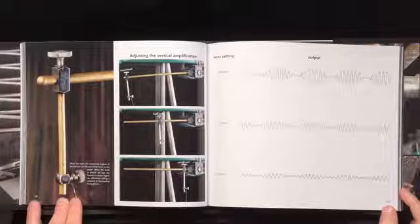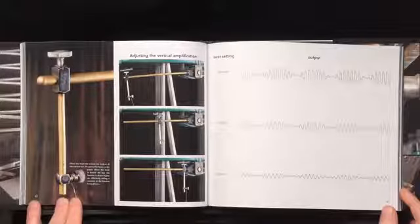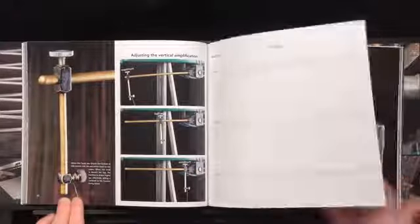This vertical rod allows the operator to adjust the vertical position of the output on the paper. In electrical engineering, you would call this the DC offset. Adjusting this knob is very difficult because the position of the pen is very sensitive to small changes on the rod. Also, the magnifying lever which is attached to it can wobble up and down during adjustment.